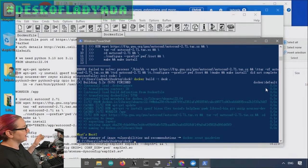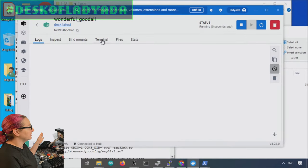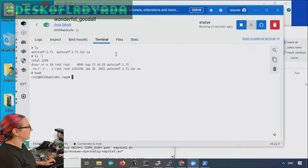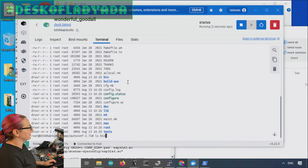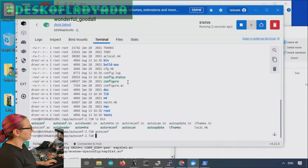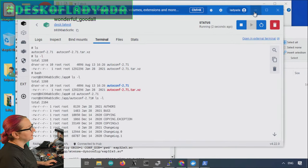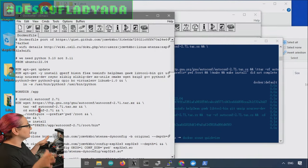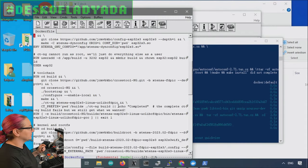It'll do all the installation and then you can Docker in. Notice it's a lot bigger now — it's 600 megabytes. You run it and terminal in, and now you'll notice there is autoconf and the binaries have been installed. So you can run autoconf and see that it's installed. So now we have this first part of the toolchain installed. It's not a one-to-one — you can't just paste the shell script in and be good to go. You do have to do this matchy-matchy part. It took me like one or one-and-a-half baby naps going through and adapting all of these instructions to make the Dockerfile.